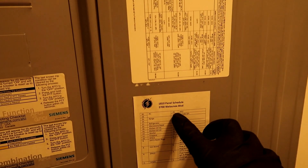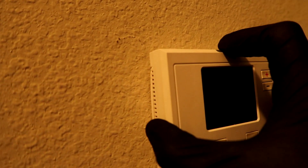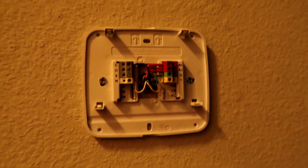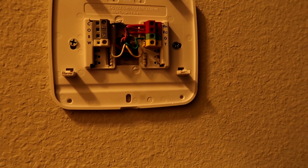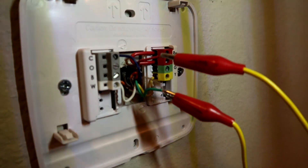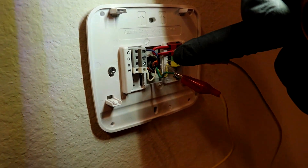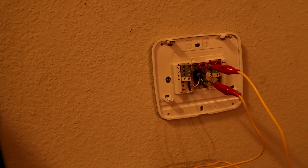I'm going to turn the power off and see what's going on — let me get the cover off. This makes you wonder if they got it set to heat pump or something. I pulled green and red out of the thermostat and got them jumped out. Red is the power coming to the thermostat and green is for the fan. Let's see if we can get the fan to come on and see if we have low voltage power. Yeah, the fan's on.